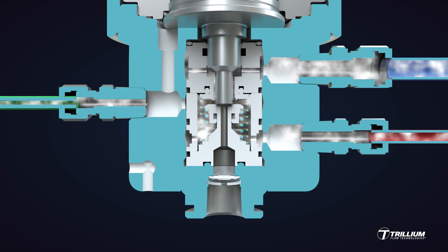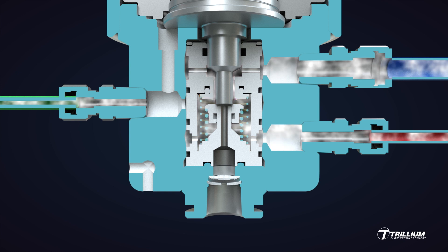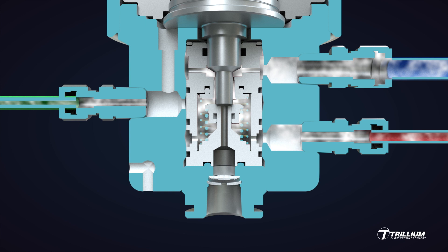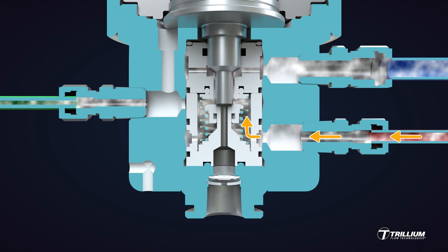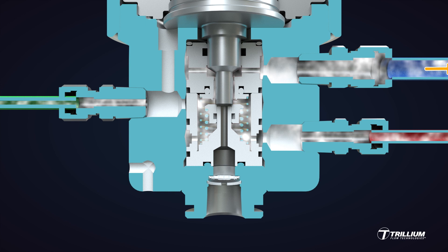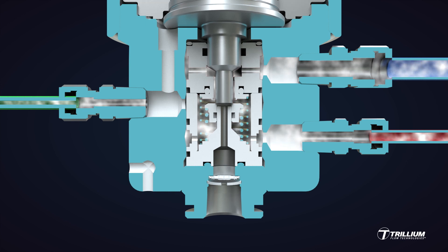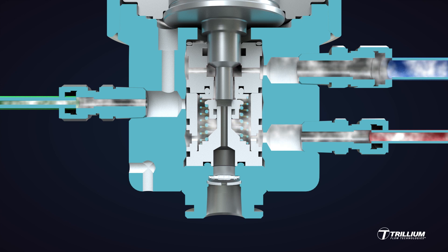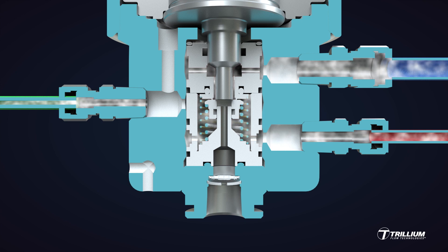We are looking at a feedback disc which is balanced between the returning spring and the drain spindle. This configuration ensures a continuous smooth balance into the system. The stroke will be naturally restricted by the feeding seat. As the drain spindle is in a low position, the pilot keeps its regular closed position. The feeding and control lines are connected to each other, and the main valve dome can be pressurized. As the pressure increases, the piston raises the drain spindle and the pilot is balanced to achieve its neutral position. Modulation has begun.